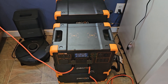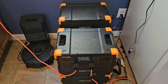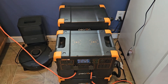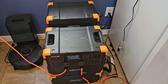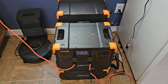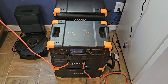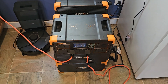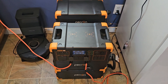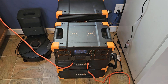During Hurricane Helene, I had power down for about four days. Like I said in the very first video, had I had this setup right here, I would have been able to run my refrigerators without having to use a generator, which would have been a pretty big deal. But even having the single-head unit with the generator, I saved a lot more fuel than I would have running the generator all the time. I could set it to a 50% charge rate and run my Westinghouse right at idle speed, kicking out 700 to 800 watts, and that charges the unit up pretty quickly depending on the state of charge.